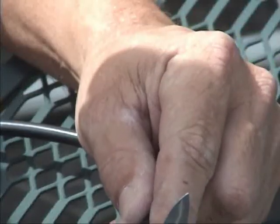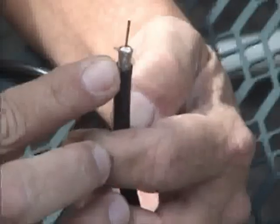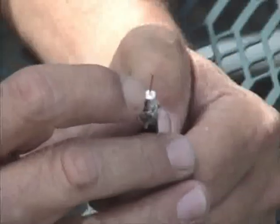Now I'm going to make a second cut about a quarter inch that just goes through the rubber jacket to the shield. Do not want to cut the shield. Pull that off. Now this is a really good cable — it's got a very thick shield. Peel this back. It's got a solid foil surrounding the white foam.